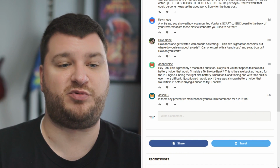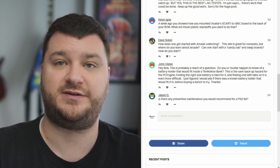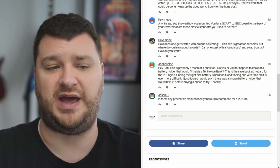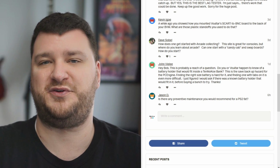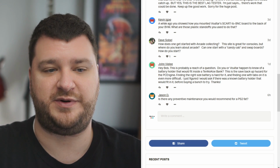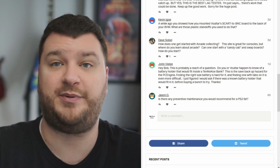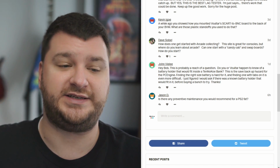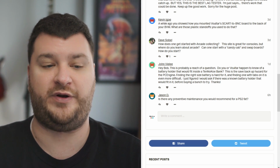Jason D asked if there's any preventative maintenance you would recommend for a PS2 FAT. I would just check the laser. If you have a scope, check it, see if it needs to be replaced. I think some people have talked about greasing the gears, and then people have their different favorite grease methods. But I think that would be it. I'm not sure if anybody has talked about bad caps on a PS2 FAT yet. I'm sure it's going to happen at some point, but I'm not sure if I've heard of that being an issue. The only other thing I would check is if you're comfortable working in a PS2, because it's way harder than a Super Nintendo or anything else.